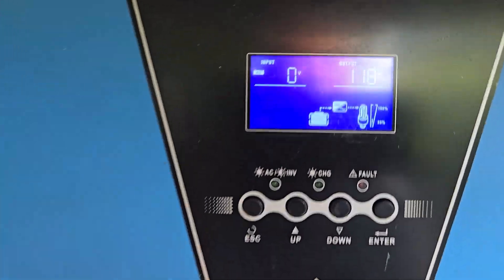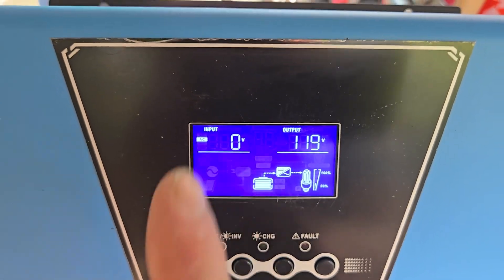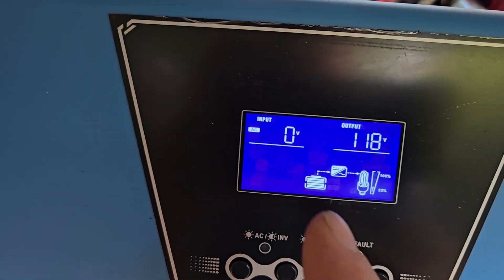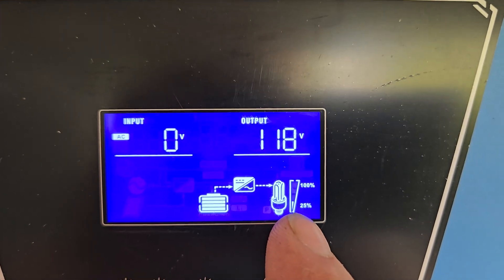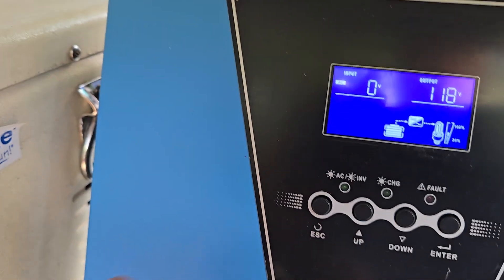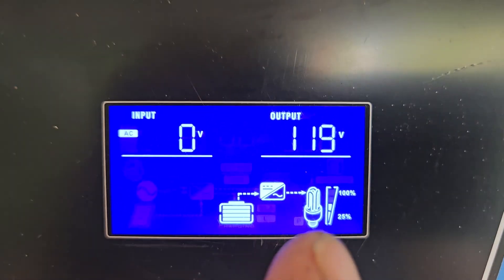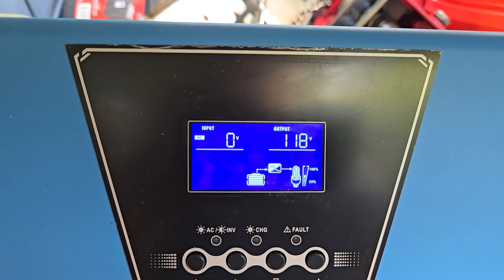What I'll do is unplug this — you hear the beeping, which is the solar inverter letting you know there was a change. Look: the AC input is nothing, the solar input is nothing, there are no inputs coming into this box to help generate the 120 volts we need to keep the AC running. You can see the batteries are at full charge, total inverter wattage usage is only 25%. The air conditioner switched from shore power to inverter power, kicked off briefly, but the compressor is now back on. The solar inverter is stable at 120 volts and only 50% power is being used.